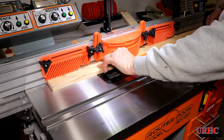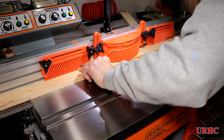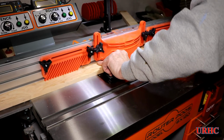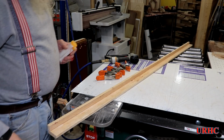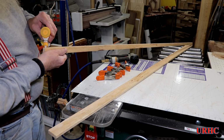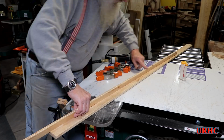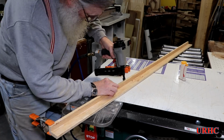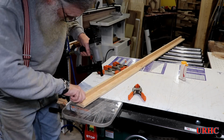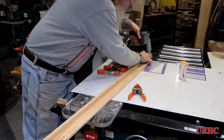So I got this piece of trim just about done now. And as I said, it's real nice having a router table that catches all the dust and does a really good job. Then to mount this trim over the doors, I had to make a spacer to go up against the track to keep it nice and even and allow me to screw it from the back. So I just glued a little strip on there and some brad nails to actually help hold it till the glue dries. And that was just a couple of minute job.